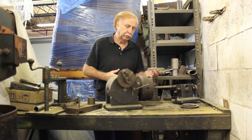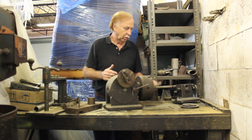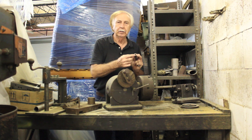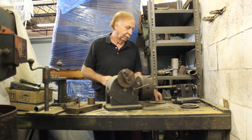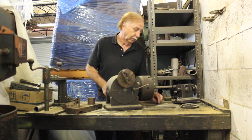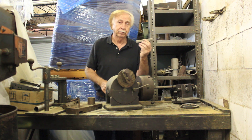After the splines were done, we'd take the piece out of the dividing head, take it to the saw, cut off the piece, and it would go to the lathe where it would be faced off and threads put in the end for the attachment to hold the cranks onto the spindle. This was a very, very labor-intensive way of making these axles at first. If you happen to own one of these with a set of cranks, we made very, very few because it was so time-consuming.